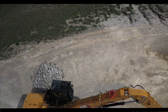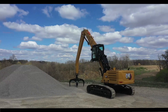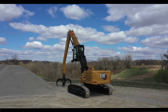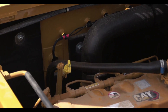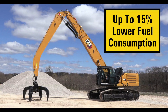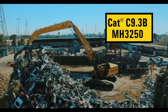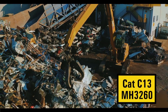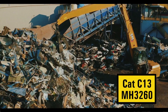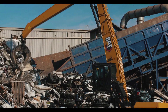The core of the MH3200 series' performance comes through leveraging components and systems used in today's next generation track excavators. Not only do customers benefit from the gains made in machine efficiency, they can also take advantage of dealer part stocking and service capabilities. The MH3200 series keeps more money in your pocket by offering up to 15% lower fuel consumption with its fuel efficient CAT C9.3B engine on the MH3250 and C13 engine on the MH3260, as well as electro-hydraulic valves. The MH3260 utilizes dual swing motors like other CAT excavators of the same size.